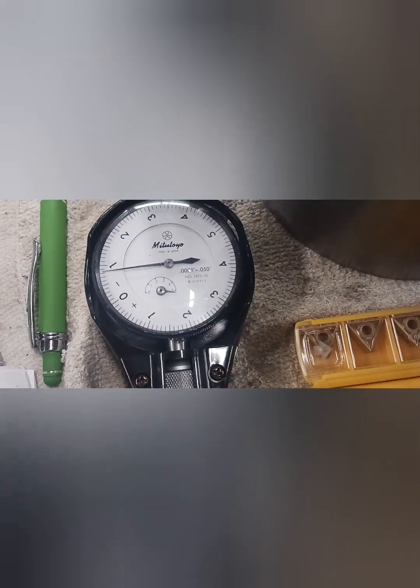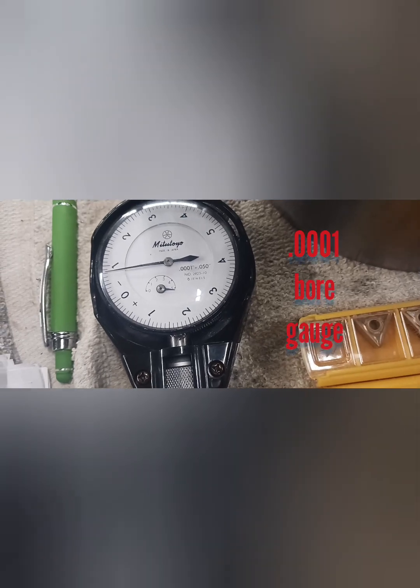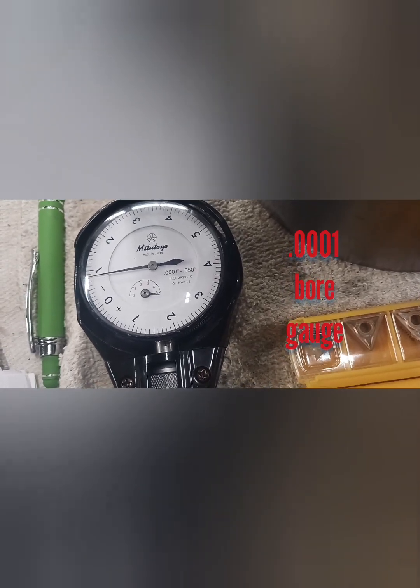It's been really busy around here — my workbench is scattered. I used a precision bore gauge, programmed out the little bit of taper I had in the bore, and finished it out. Then I set up to do the side holes.